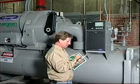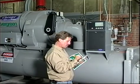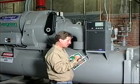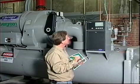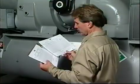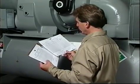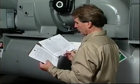Now, about your daily log sheet. Don't just take readings. When you check the temperatures and pressures, you must also know what these numbers mean. They may signal trouble, and it's up to the operator to notice it. After you take the complete set of log readings, compare the readings with the design or startup set of readings. If there are any significant differences, you need to find out why and correct any problems that may exist.